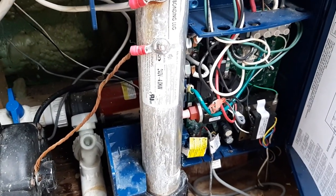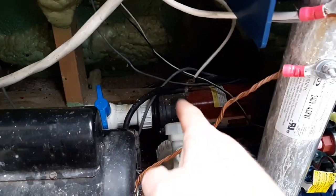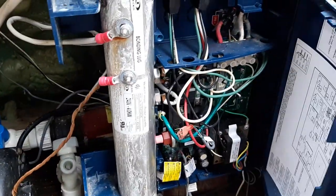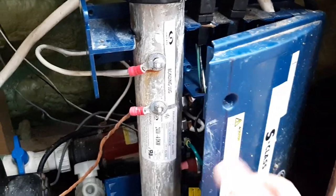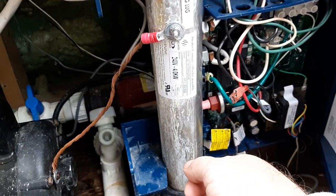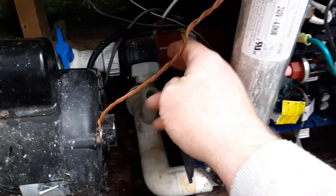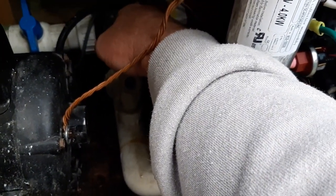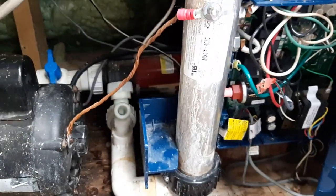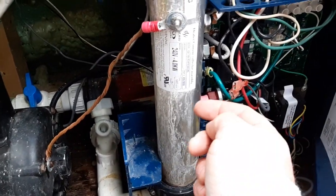What we did was turn the power off and shut the valves off — here and down there. Just watch the in-line so you can disconnect it or not; some tubs have that, some don't. Some packs have a pressure switch, some don't. Now, you don't want to pull the pressure switch out after you've shut those valves off without releasing the water. I opened up this part here and let some of the air out, then took the pressure switch out. You want to release that water away from the electrical — over by the pump you can disconnect it there and let the water go out that way, so it's not spraying all over the place.